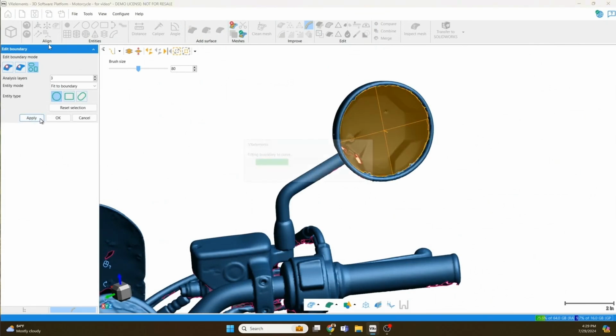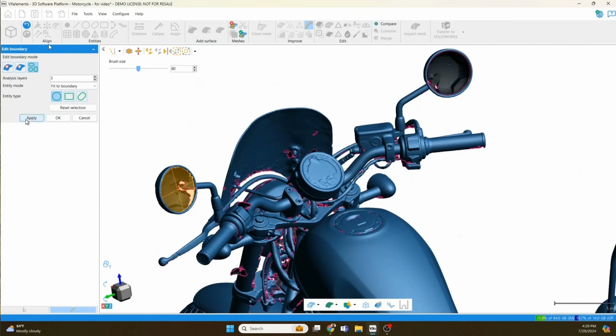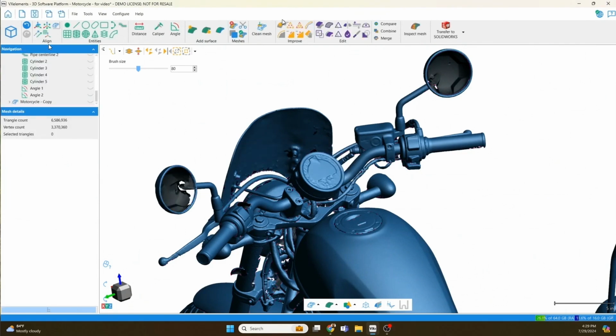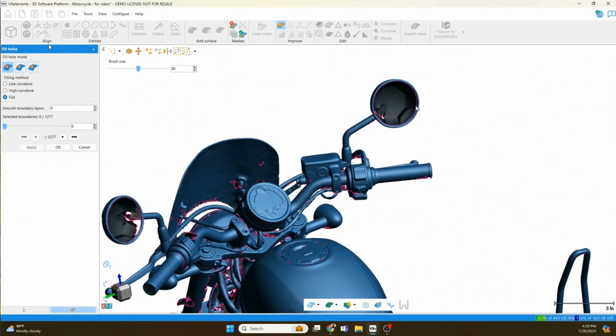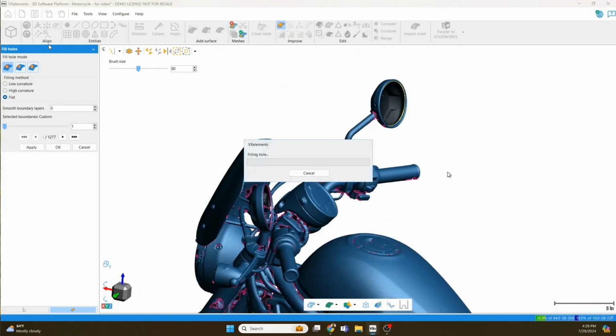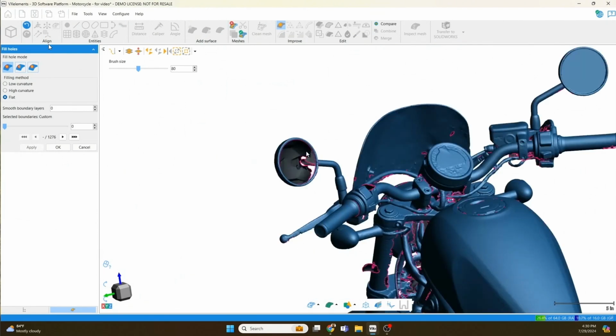So what we can do, especially if we want to make this like a complete mesh, is we can adjust the boundary of it to be a perfect circle. So you see there, we get this nice clean boundary, and we do the same thing for the other. And now that it's a clean boundary, we can do another hole fill. I don't want to do a flat fill on a boundary that's jagged, because you end up with a surface that looks really funny. But now we can do a hole fill, and instead of it being a contour fill, we can make it a flat fill. And since that circle boundary is perfectly flat, when we click on it, it'll make a very, very clean fill very quickly. So there we go. If you need to put that in there, maybe you're doing some repair for 3D printing or whatnot, or just getting a scan watertight, we've got all the mesh cleanup tools in here as well that you need.